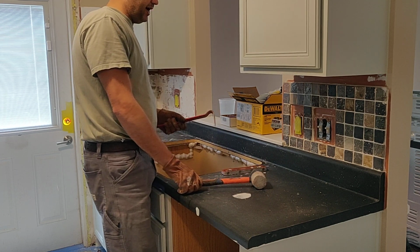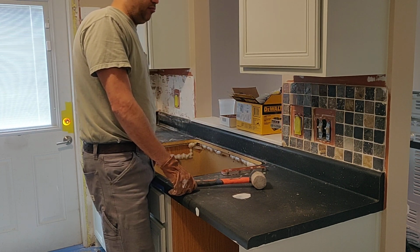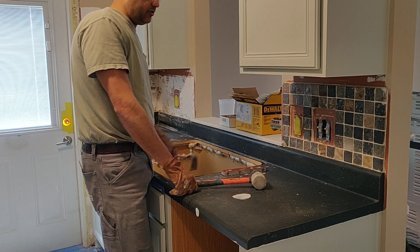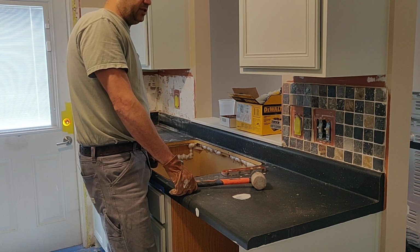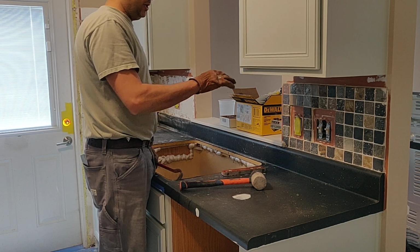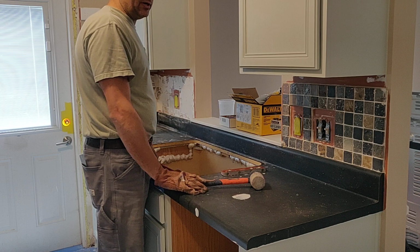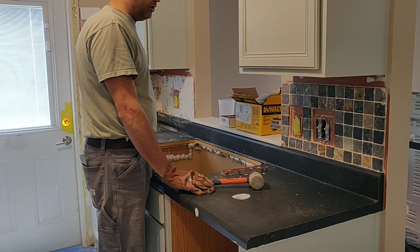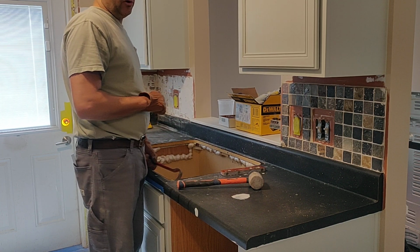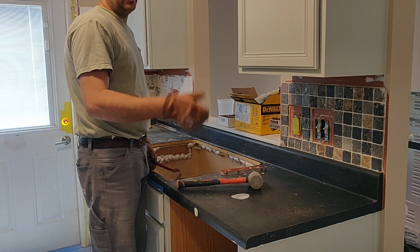When it comes to the type of tile, you want to weaken the tile first. If you can get behind that glue or whatever and break that bond, go for it. But it's really hard. Once it's grouted, it is one solid piece, and it comes off with a lot of resistance. Anytime you have something solid that is glued onto something, you want to weaken it first. If it's a glued-down flooring and a thick board, trying to get that up is going to be a lot of work. But if you chip away and break that board in half where there's not much structure left, then it's a lot easier to scrape up.